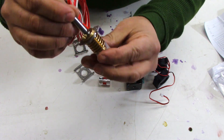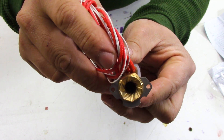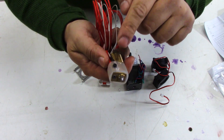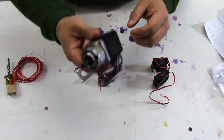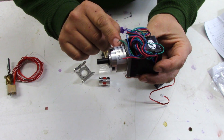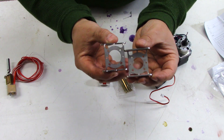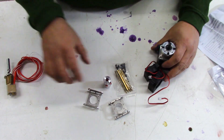The fit is nice. You'll see that the barrel is actually fluted — right in there. So it's interesting: we've got a fluted barrel. It does come with a silicone boot, which is nice, and it's already fitted with a heater and a thermistor. The extruder motor is a NEMA 17 geared motor, typical four lead. We've got some assembly hardware, brackets, and the coupler. So all in all, not a bad kit.